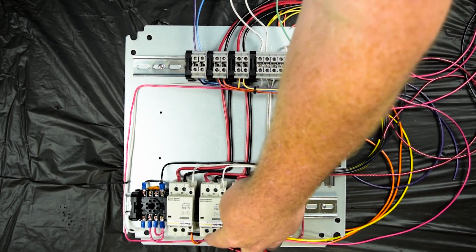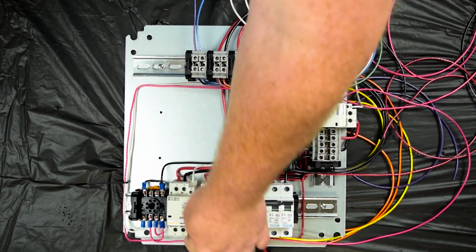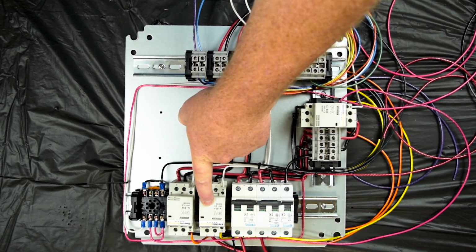We've also got the two control wires for the HLT and boil kettle relays, and those will go to the three-way switch that controls these. You've got the neutral on this side to make the connection, then the power side will come in here, and that's what will actually switch these on and off.